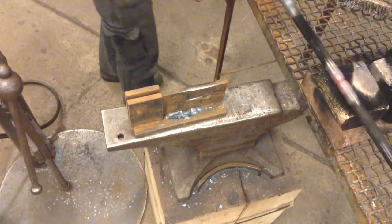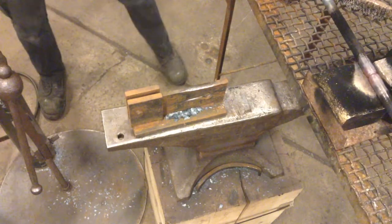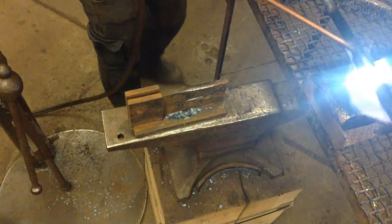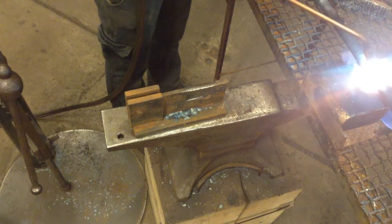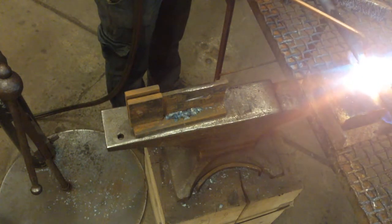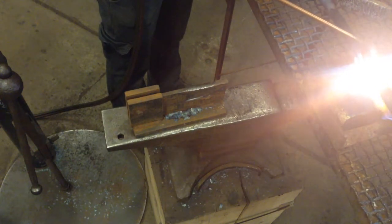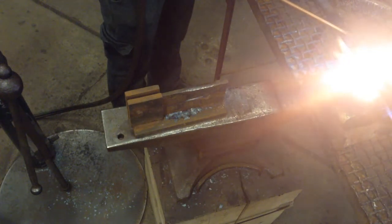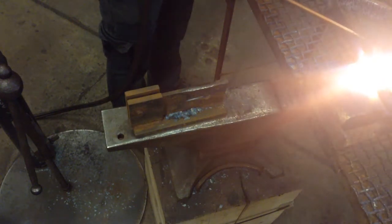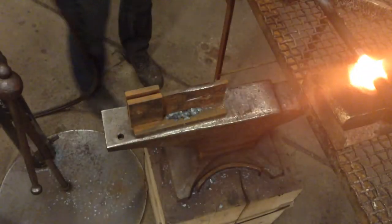Now that we have a good neckline established right here, we need to keep it really upset. Again, cherry red — hot enough to light the torch. You want to get just above that neckline, the shoulder, hot as well, because you want that section to flare out to give you the shape of the knuckle of the bamboo forming before the interface between the two knuckles. So get just above and just behind the dome section where we've cut that neckline.